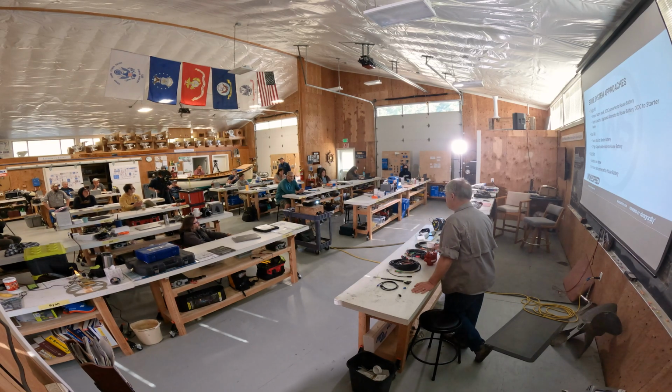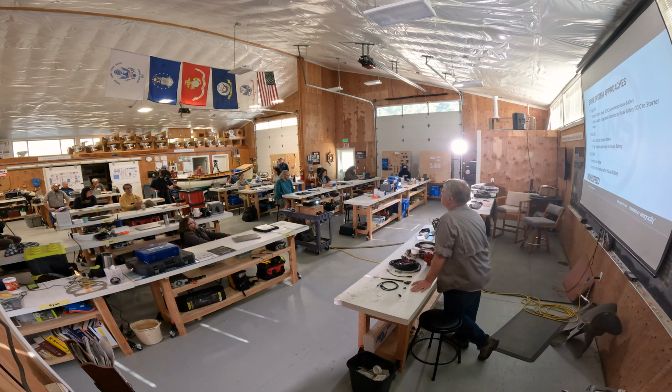To that point, and while we're still in dual alternator world, when we add a second alternator, the assumption is it will be correct brackets, correct belt and pulley ratio, correct alignment of things. Everything's done to ABYC standards. Could you speak a little bit about how not to fall into the hole of taking all the data into consideration, the use pattern, the loads, everything, and now you've arrived at a second alternator optimal output.